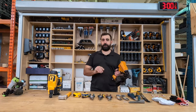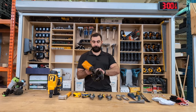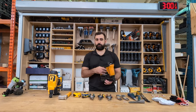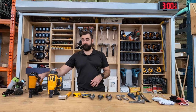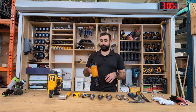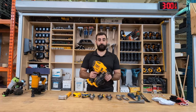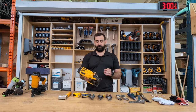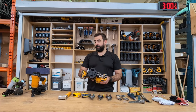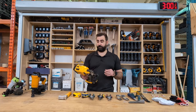Next, we got our nail guns. We got our pneumatic air gun — this one's a coil nailer that fires a different range of nail lengths, most importantly your inch-and-a-quarter and inch-and-three-quarter. This is your everyday-use air nailer. Another nice one we have is a Dewalt 20-volt battery-operated nailer, which comes in handy when you're doing repairs or roofing a small job. It's a little heavier and a little slower than your pneumatic, but you can do quite a bit of roofing with it as well.